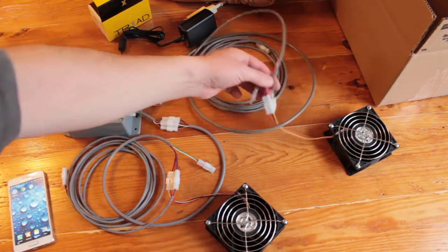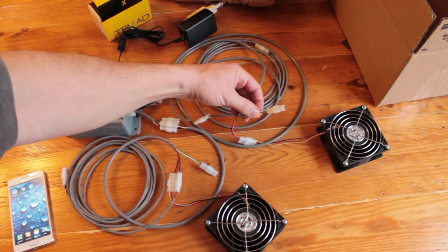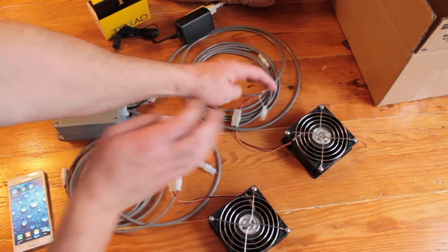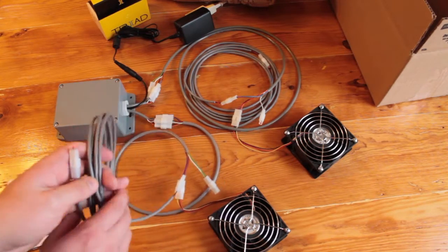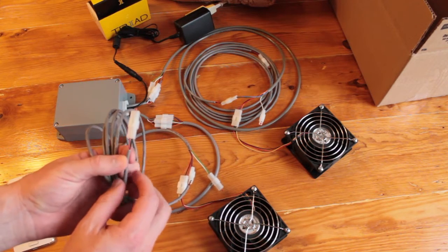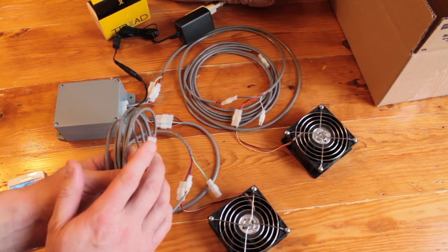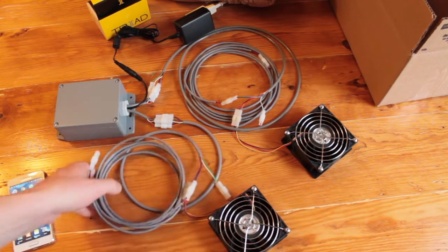For the second heater, mount the sensor — which is on the white/green wire pair — behind the second fan. The second sensor for each heater is on a nine-foot long extension cord. Simply put it inside the inlet of the solar collector so we can monitor the temperature of the convected air prior to the fan switching on. Once the fan is on, it monitors the room temperature.